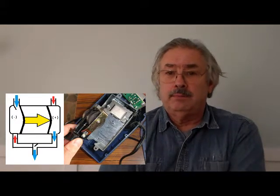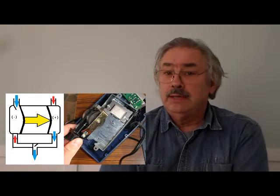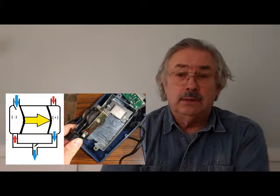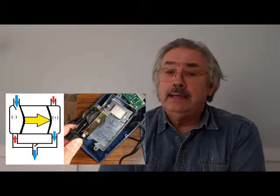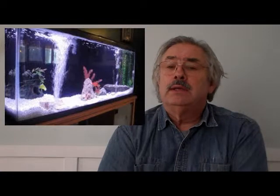There are various types of compressors and pumps available. The simplest is called a diaphragm pump — basically two diaphragms which move right and left, either pulling air into a chamber or expelling air out. It's a nice simple system, often seen for small aquariums, but it can also handle fairly large systems. The diaphragm may need to be replaced from time to time as it ages or dries out.